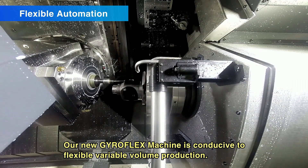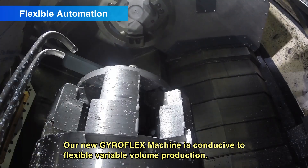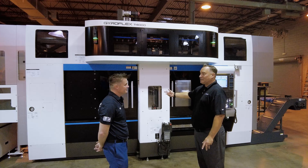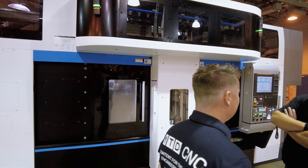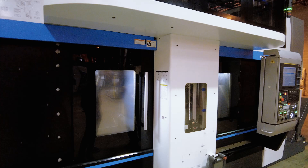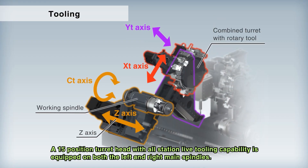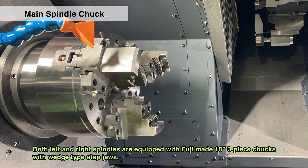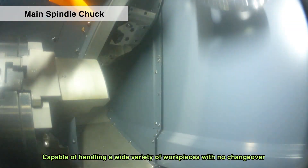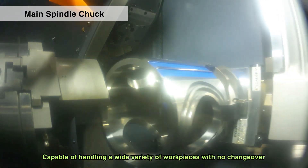Very interesting design — we bring the tool down with the ball screw and then our arm changes here. It's about 11 seconds from top to bottom and about 3 seconds from chip to chip if the tool is loaded at the bottom already, pre-staged. Very quick operation, very flexible machine, XYZ axis, live tooling capability in each station, 15-station turret on both sides, large capacity main spindles. This machine is offering a lot of flexibility to get a lot of work done for complex parts.